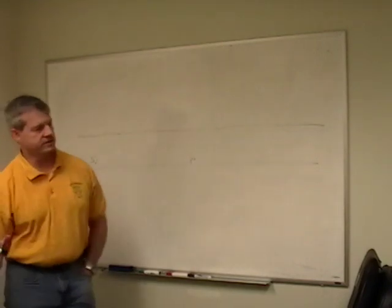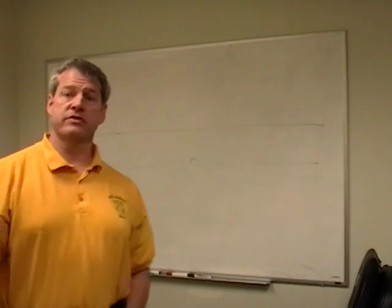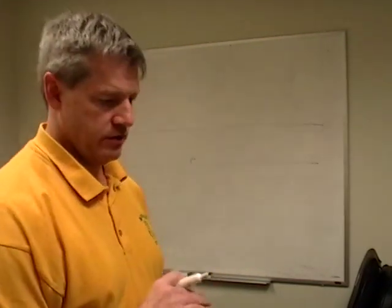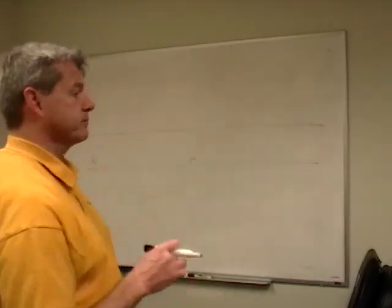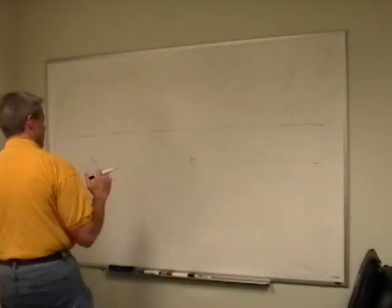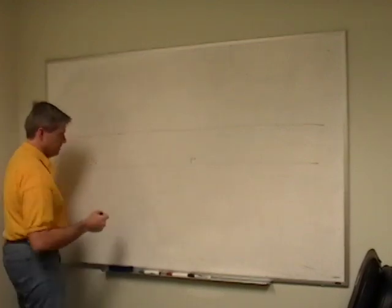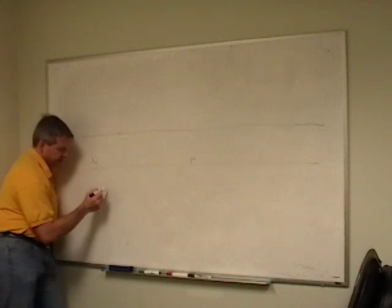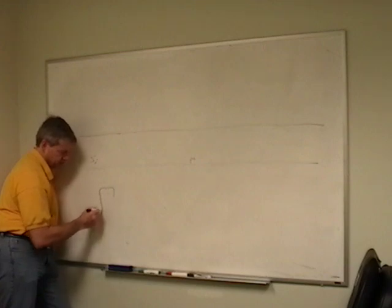But what we do in our processing is we grind these off. We make photomasks just like they make printed circuit boards and whatnot, right? You expose it to light, you smear some stuff on, you expose it to light, and then it becomes resistive to etching, to chemical etching. So we put a pattern on them, and the pattern, if you've ever done any VLSI, you'll have something that looks like this.